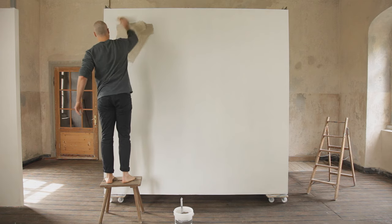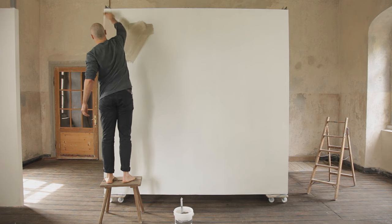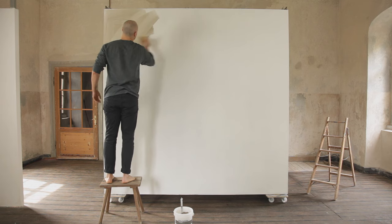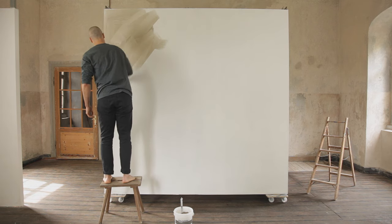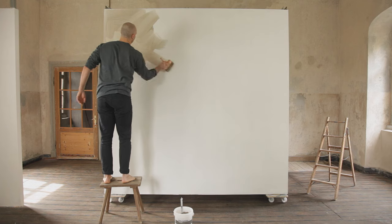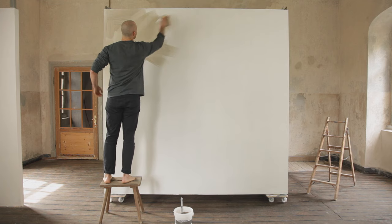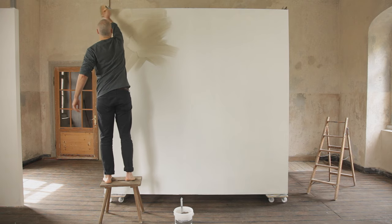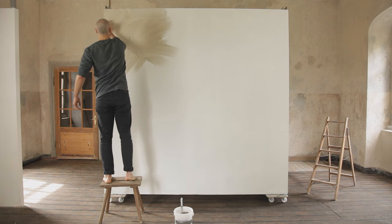First, starting at the top of the wall, but away from the edge, we start spreading out the paint, blending back into the edge of the wall. We're spreading the paint out as far as it naturally goes, with gentle, easy but firm strokes, in a random way to create cloud patterns. These cloud patterns offer an easy way to achieve texture.